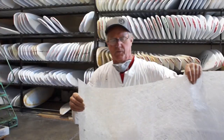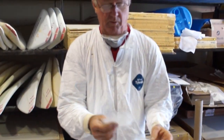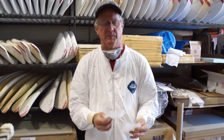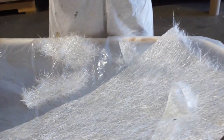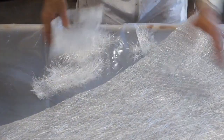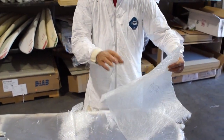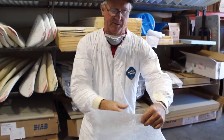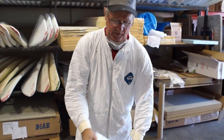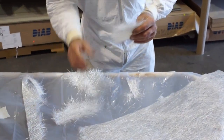This is a three-quarter ounce mat, which we're going to use to lay up. When you use mat, a lot of times — especially if you're using it in a curved situation, like compound curves — it's pretty stiff stuff. When you wet it out with polyester resin it softens up quite a bit, but a lot of times you can use flat pieces on a flat area. In the curves, I always just tear it up into little strips and stack strip upon strip.